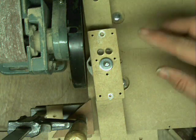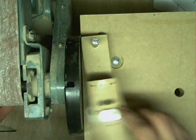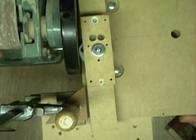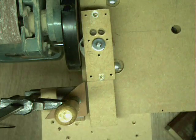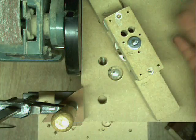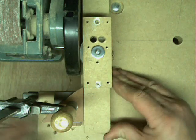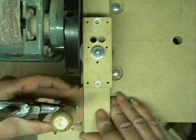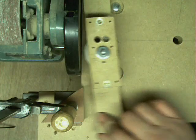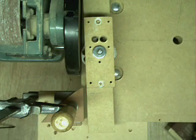Something a little different this time - I've used the peg. So we can do - that's the peg we use for there. Just drill 10mm, 10mm in there. You can put a nut and bolt and washer on that if you want - I sometimes do. This time I've put a stop, because we don't want to be going silly on this, and it's not going to do itself - we've got to do it manually and we've got to make sure we stop. So I've chosen the lowest point to put my stopper. Now you can actually see it's not quite in line, but it will be when they're all correct. So at the moment I just do that and just keep moving it until I hit this, all the way round, and I know it's done.